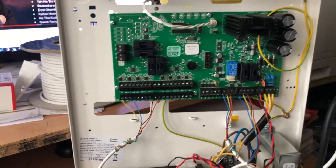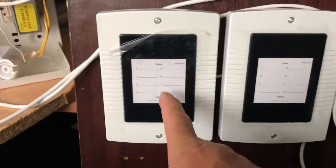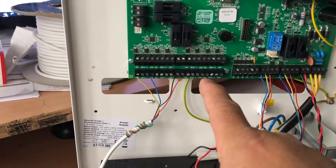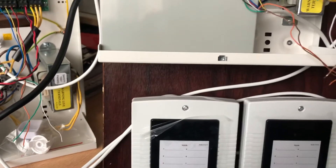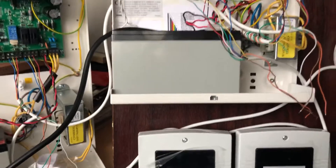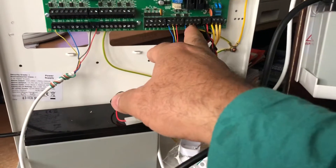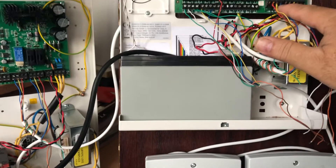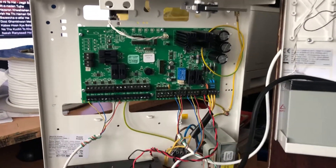As you can see, I put one ZM panel plus PSU power supply, and this also uses expander 1 and expander 2 ZM. The panel has 8 zones, and then 8 zones here, 8 zones here, and 8 zones here — so 8 times 4 is 32 zones altogether. You can add more expanders, but you have to take the power from the PSU in this area. The reason is if you put too much load on the main panel, the power supply could be damaged. That's why I use PSU power with the Pyronix system.